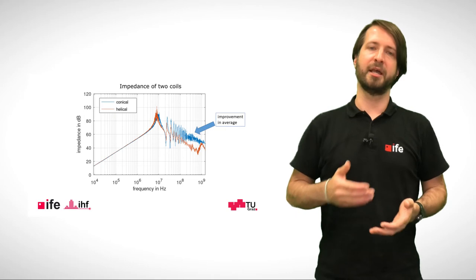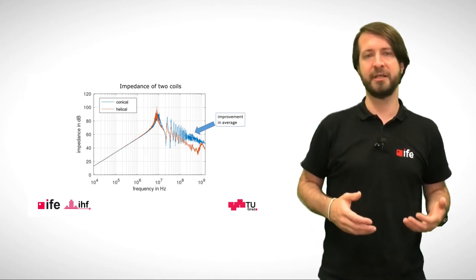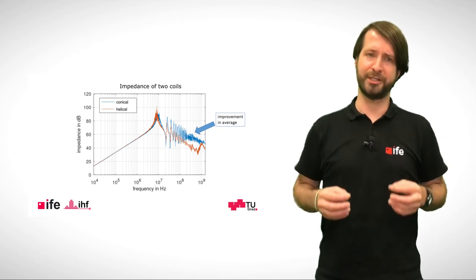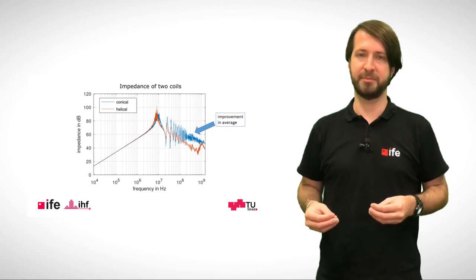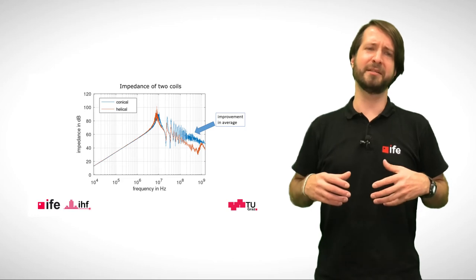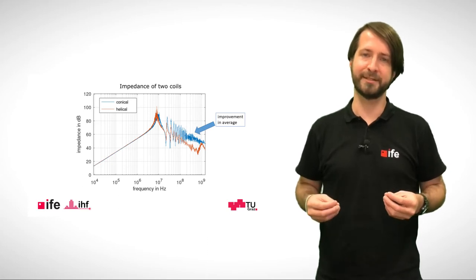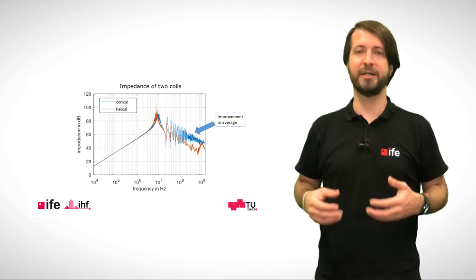These resonances have a threefold negative effect on the system performance. First, the anti-resonances may reach low impedance values, which requires strong correction during calibration. Secondly, even if they could be compensated by calibration, they must remain time invariant. If the geometry of the coil changes slightly during the measurements, for instance due to thermal reasons, this may move the resonances, which would require a new calibration.